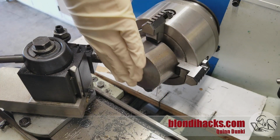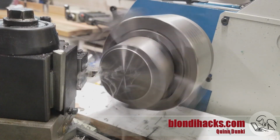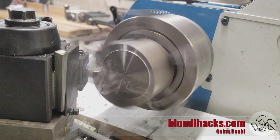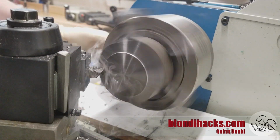And the setup turns out to actually be working quite well. So now I'm doing 40 thou passes. Now the one challenge I did have is you can hear here that I'm fighting with chatter a little bit. And it's wanting to chatter, again, because of that large oscillating mass that's swinging a little bit off center. And so it's setting the machine up for failure chatter-wise.